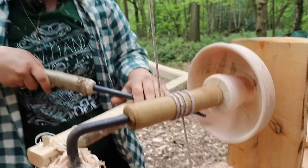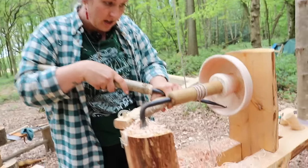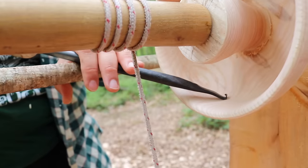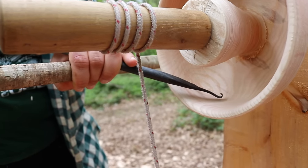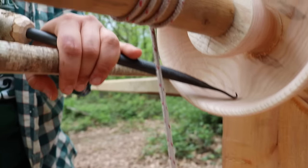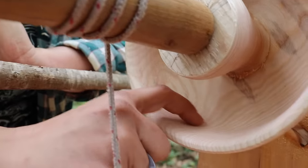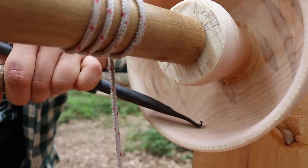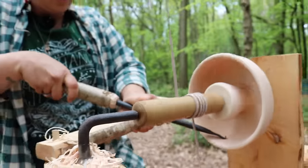If you're here and you're feeling it's tricky, a lot of it is a repetition of what you've done before. So I take the back of the tool and it's sitting parallel to the face that I'm cutting. And then when I start turning, I'm going to slightly rotate the cutting edge in, and then once it's engaged, I'll follow that and keep it going. And again, like I did earlier with the pencil, if you can, I don't know if the camera registers these little white lines in here. The angle of the cutting edge is like a little check mark. So you're at an angle, you're cutting, which makes that slice and a clean finish.